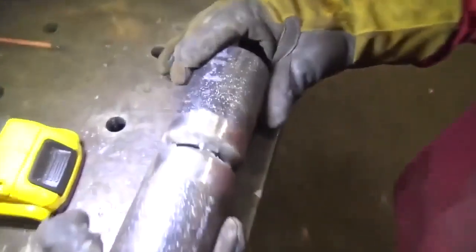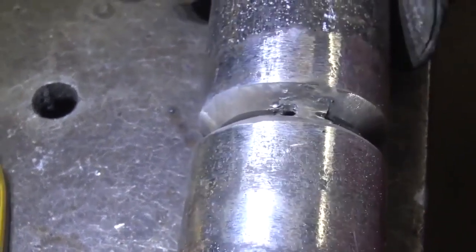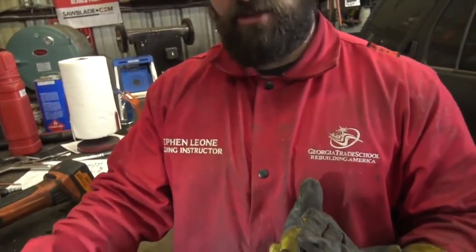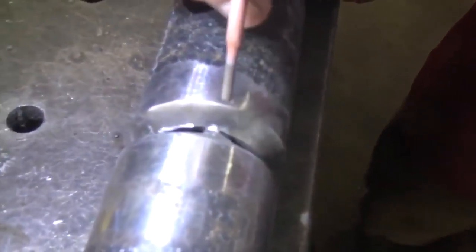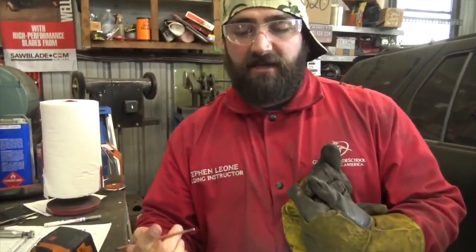We've got keyhole on both sides now. You actually have two options: some welders want to blow through the tack and completely consume it; others just want to tie in on either side — both work. However, if you plan on consuming the tack, you need to grind it down considerably, and you run the risk of popping tacks. If you feather all tacks down and weld one side, the back side will more than likely pop open, which wastes your prep time. I always suggest tying in.